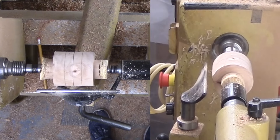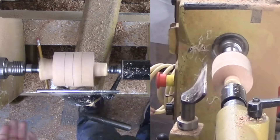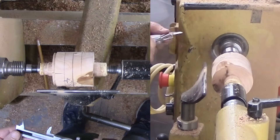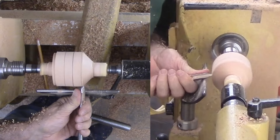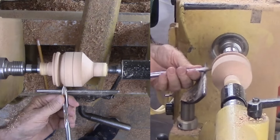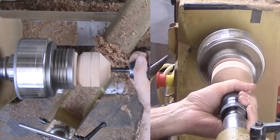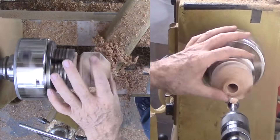Since I will be hollowing this project, I need to use a chuck which needs a new tenon. Then cut the corner off the tailstock end, but since I need a chuck mount, I can only cut a little from the other end — this is to give some indication of the limits for hollowing later. With the wood now mounted to a chuck, I start by drilling out the center with a ¾ inch Forstner bit to a depth that looks good for the diameter. Then, still following the octagon method, I mark divisions on the available faces to guide rounding off the sphere by eye.